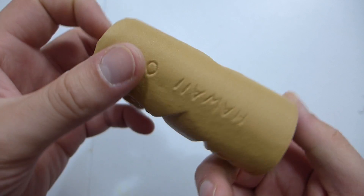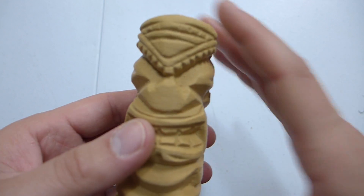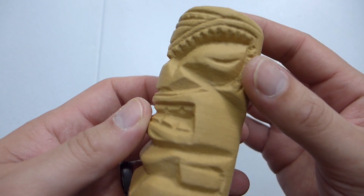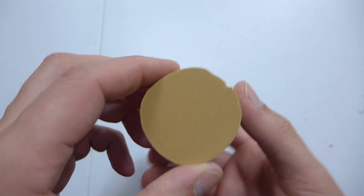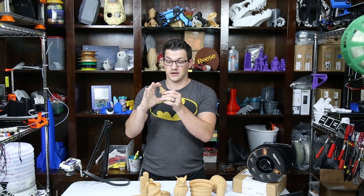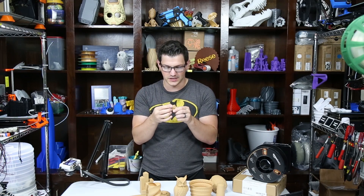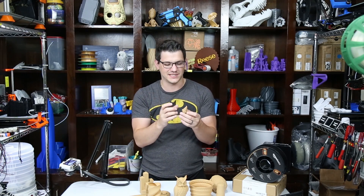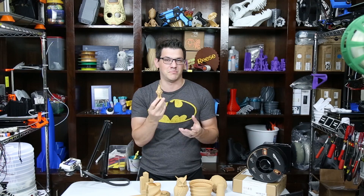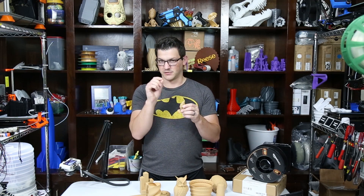Here's a Tiki statue — this is from Hawaii07, somebody actually 3D scanned it so it's a little bit soft-looking, not very tight lines on it, but overall really nice. No underextrusion in any of these prints, which is really nice to see. I also printed out the Protonome at 100% scale and he turned out gorgeous looking. The few retraction artifacts you can kind of see in there — which happens with wood filaments — you really have to tune in your settings. I use a slightly modified PLA profile on my printers for wood filament, and it could still use just a little bit more tweaking.